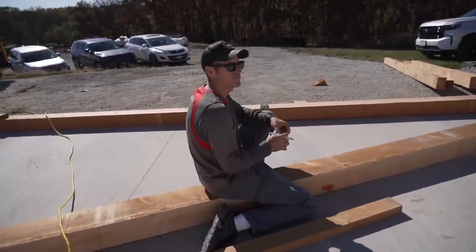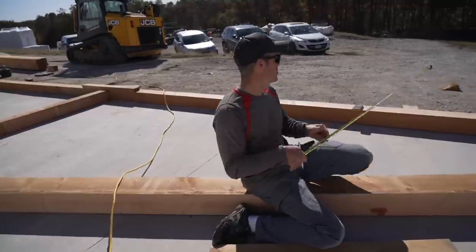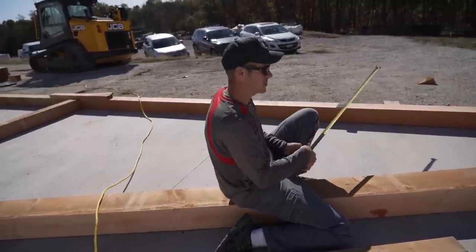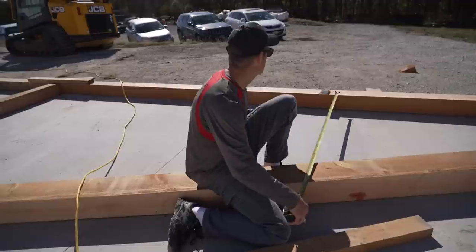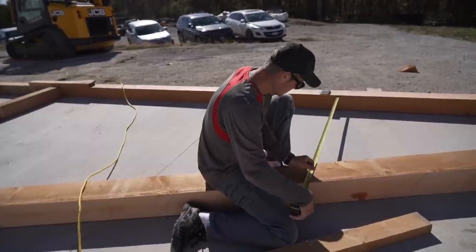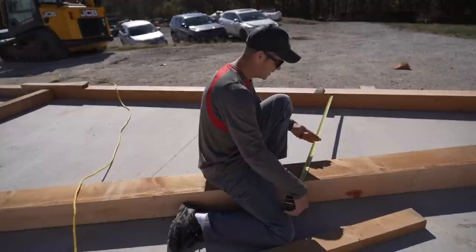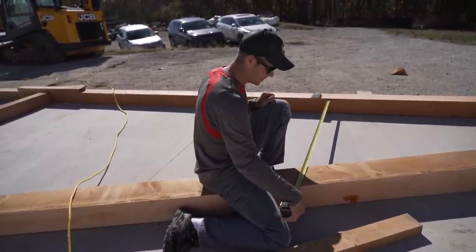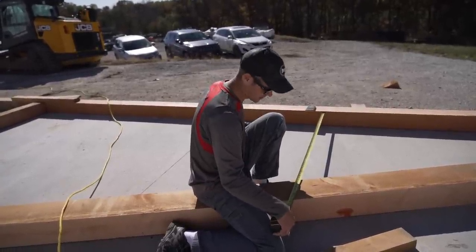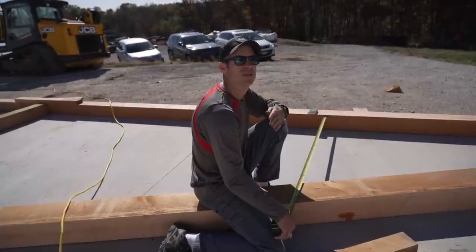I'm building all the support in the middle. I have one up the middle, and then I'm going to come off the bottom up at an angle. Being this is so wide, I came in half the distance to the middle, which is 12 feet, and then found what my angle measurement is, which is 13. That should be 60 inches from the top of that to that mark — which it is. So I need to cut one at 51 and a quarter inches at the center of my upright, so it'll fit right in here. And it should be that same 67.4 degrees. So I'll go ahead, mark the other side, and cut those two and get them tacked in.